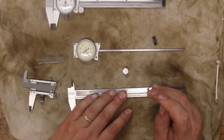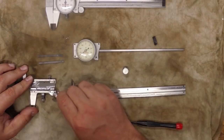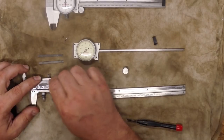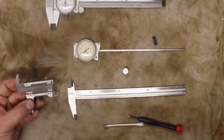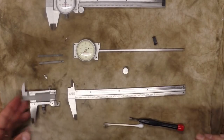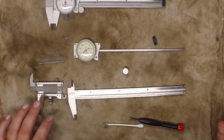All right, so that is all back together now. Give me a fresh Q-tip and we're going to clean this part out real good — same thing, just get in here and scrub it with that Q-tip. I really don't like using anything like a wire brush. You can probably take a little brass brush to this if it was really bad, but quite honestly the Q-tip is all you need. That will usually take care of it. The nice thing about the alcohol is that it evaporates very quickly, so if you don't get it all wiped out you're not going to leave a residue. Some solvents leave residue that can then attract more grease and chips. So I like using the alcohol for this.